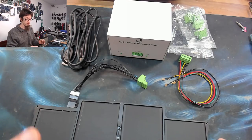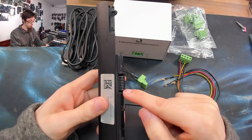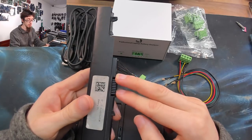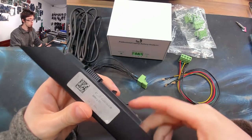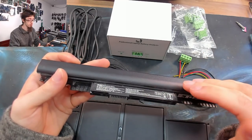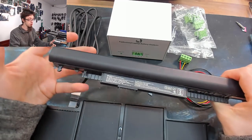Quick summary of what this is. If we take any typical laptop battery — here's an HP laptop battery — it's got this proprietary-ish connector on it. This device connects up to that connector and talks to the controller inside the battery, then displays through the software all the parameters including how many cycles it's done, its maximum and minimum capacities, serial number, when it was made, and the overall health of the battery.